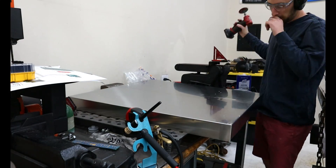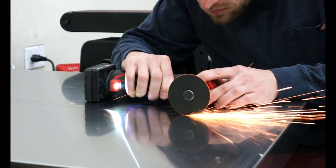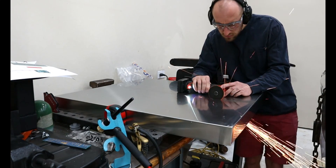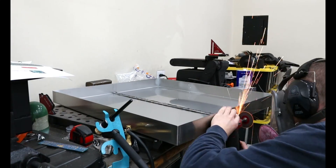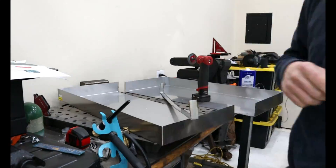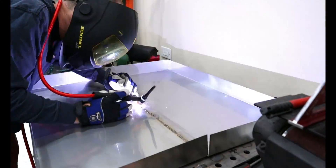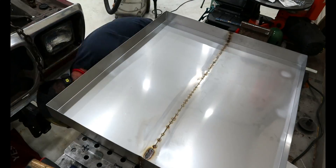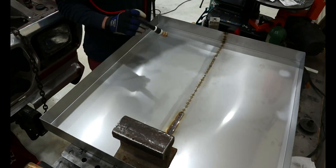I'm always looking for ways to save a buck, and well, this time it bit me. I bought a slightly oversized water pan which does not fit the table dimensions, with the intention of cutting an inch out and welding the seam — all to save $50. Who doesn't love welding stainless, right? Well, this was probably the most difficult thing I've ever welded. No matter what I did, I kept blowing through the material, resulting in me patching the hole with filler and putting even more heat into the material. After I finally welded the seam, it was apparent I had warped the entire pan. I tried to stretch the material out as welding shrinks the metal, but I was unsuccessful and ended up buying the pan JD's Garage recommends. So instead of saving $50, I ended up spending $100 more.